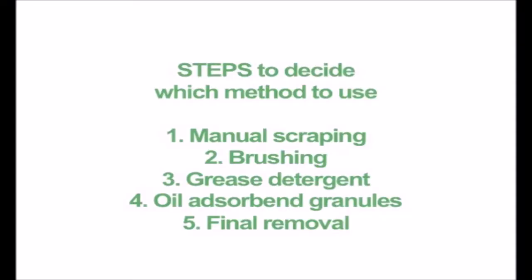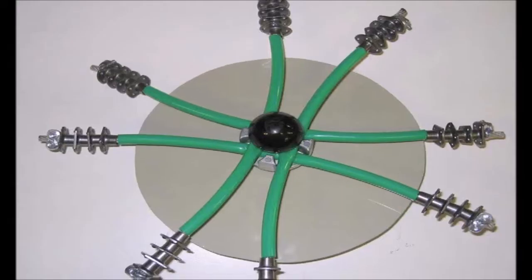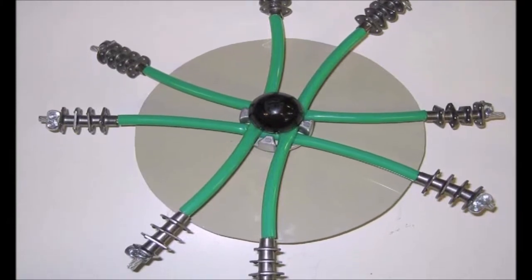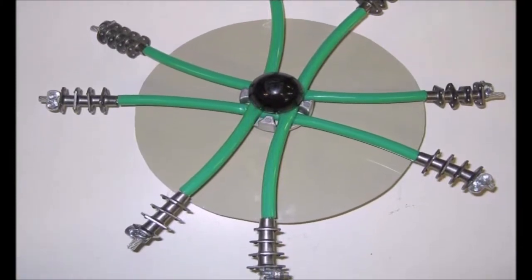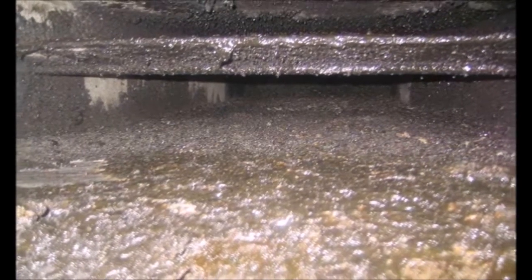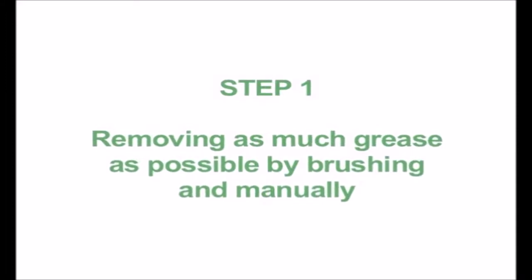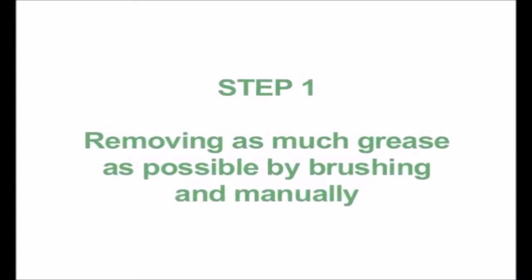The method was originally designed for regular maintenance, not making years of negligence disappear. However, if the grease chopper can be used due to the noise factor, also thick and heavily burned grease can be released. But remember, you still need to remove it from the bottom of the duct. In practice, those sections with heavy sticky grease are mostly removed by hand. Dry grease can be brushed off.